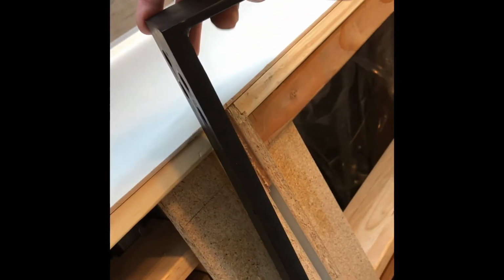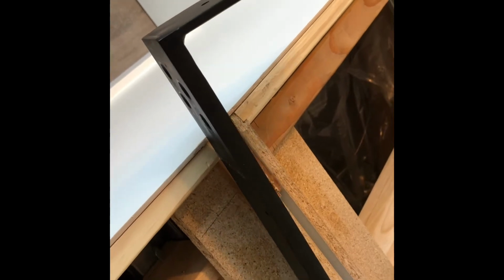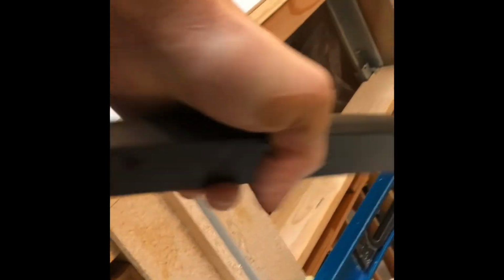Watch out for those cheap knockoffs on eBay, handmade in people's garages, that are this thick or less, and then they're bendable. If it's bendable, guess what's going to happen to your countertop if you're using granite or stone? It's going to crack, and you're going to lose out on a $2,000-3,000 slab of granite. It's not fixable once it cracks. Anyways, make sure you purchase something at least a ½ inch thick with quality.